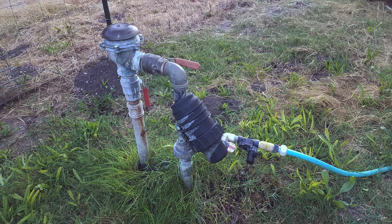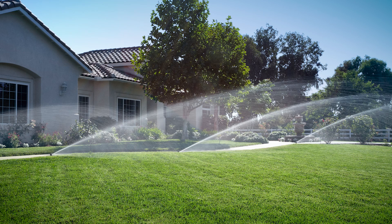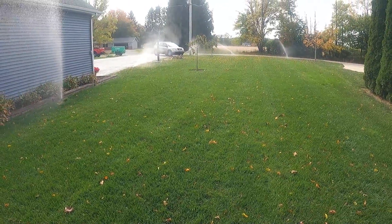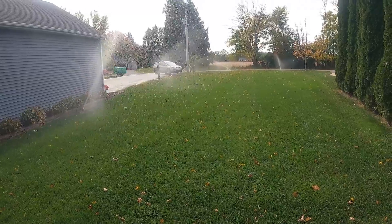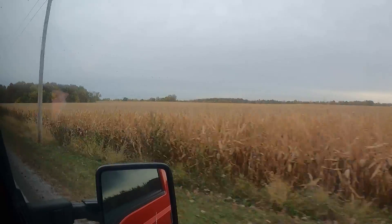This was on a grassy slope but you could create a rock pit such as a small French drain. A side note about alternative water sources for irrigation is that pumps tend to be set for house use and aren't considering the needs of landscape irrigation. If you have standard pop-up sprinklers and a reasonable number of heads on each line, then you should have the pump set at about 65 PSI. If you are operating rotor sprays, then it should be about 75 PSI. Most systems I see are only set at about 40 PSI, so low water pressure is another common issue I deal with on alternative water systems.